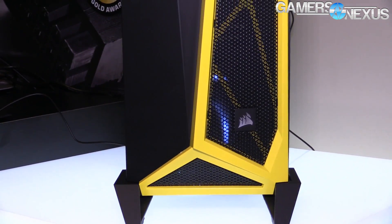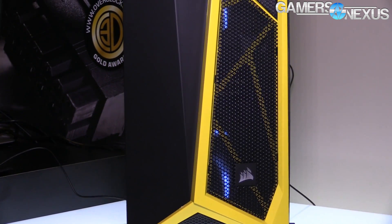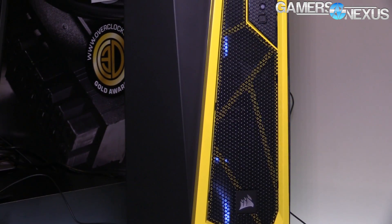All of this is very expensive. If you custom tool a chassis from the ground up — like these two cases were done completely custom — that can be literally hundreds of thousands or even a million dollars in tooling. I was told that the HP Blackbird case cost almost three million dollars in tooling; the foot alone was a two-hundred-thousand-dollar cast aluminum part. We don't have a three-million-dollar tooling budget, but these cases are definitely hundreds of thousands up to a million. A 900D is a very expensive case to tool because of the part count — that's the primary cost driver, along with how many stamping stages are required.